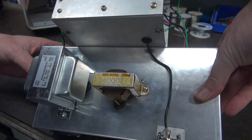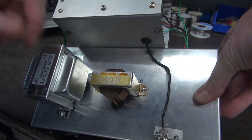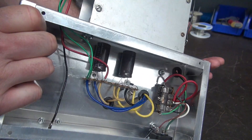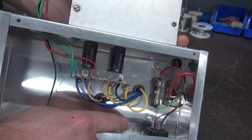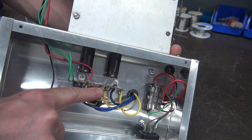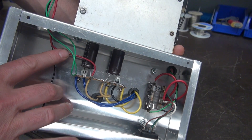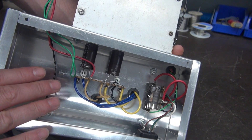There's plenty of distance so I have no worries about any shorting between the chassis and those terminals. Let's go over the power supply section. This is my main power transformer with a little choke. The AC input goes through a fuse, it's rectified, a couple of filter caps, we've got our high voltage here and six-volt filaments that feed the VFO cage.